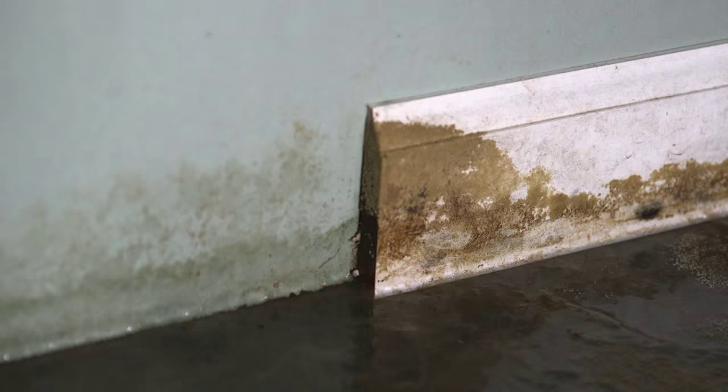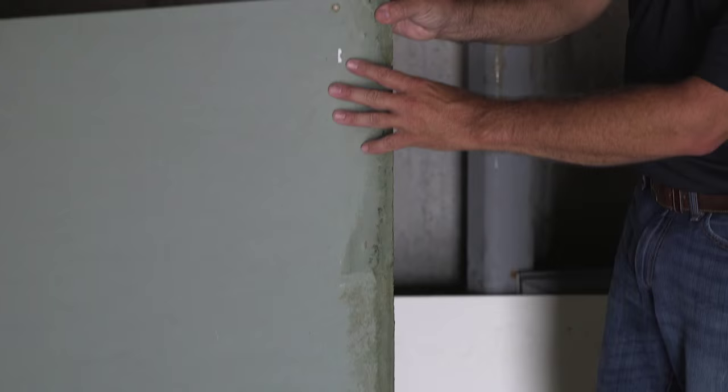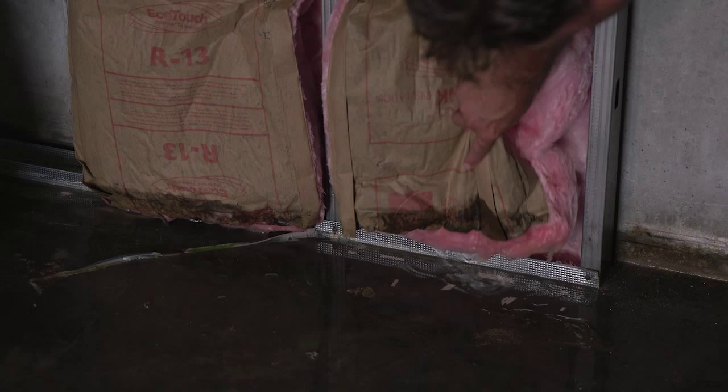The moisture and mold resistant drywall panels were next. The pre-primed wood baseboard got moldy right on the paint. The moisture resistant drywall was moldy at the bottom — although it did perform better than regular drywall, it was still moldy. When weighed, the panel sucked up over seven pounds of water, or three quarters of a gallon. The fiberglass insulation behind the mold resistant drywall also got moldy.